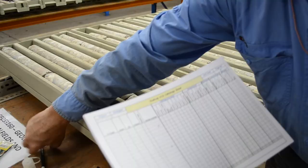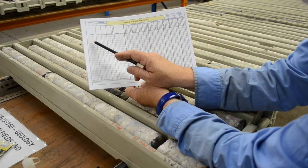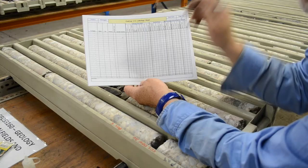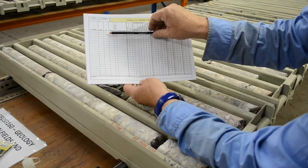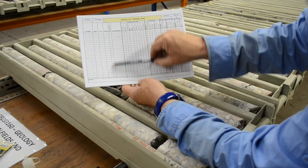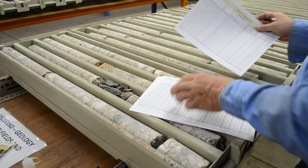Here is a logging sheet — this is typically what logging sheets look like. This one's called Coal Log, for logging drill core. It's a table with depth from, depth to, the observation, seam/ply/horizon — trying to identify which part of the stratigraphy you're working with — and then columns for lithology, geotechnical, mechanical, sedimentological, and observed minerals. Each row represents an interval down the drill hole, and once the depth is established, the parameters are filled in across the table to develop a database of information. Coal Log is an industry-supported logging standard and a very good system.